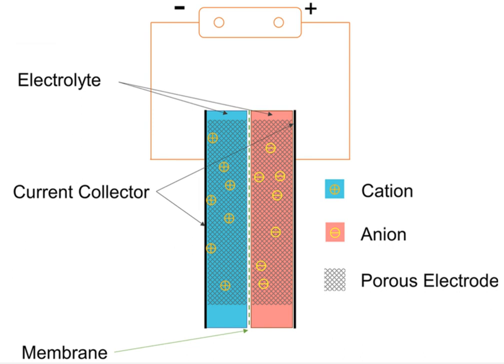In the table, ESR refers to the component with the largest capacitance value of the respective manufacturer. Roughly, they divide supercapacitors into two groups. The first group offers greater ESR values of about 20 milliohms and relatively small capacitance of 0.1 to 470 F. These are double-layer capacitors for memory backup or similar applications.